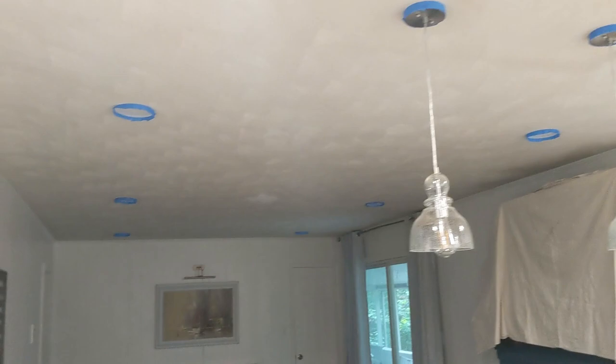I've taped off all my light fixtures, and now it's time to start painting. I'm going to start at one end of the room and make my way towards the other end. I'm going to cut in around the edges of the ceiling where it meets the wall with my angled paintbrush and also around the lights that I've taped off, and then come back and fill in with the paint roller. I'm not going to cut in the entire room before using the paint roller because if the paint around the edges completely dries before you come back with the roller, it can end up not looking completely even — the edges might look a little lighter or darker than the middle. It has to do with maintaining a wet edge as you're painting. So I'm going to do a small area of cutting in and then come back and fill in with the roller.